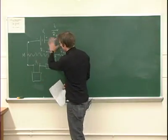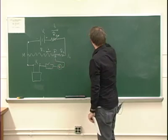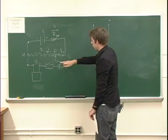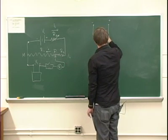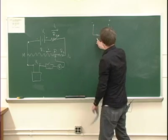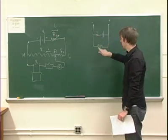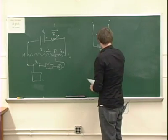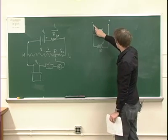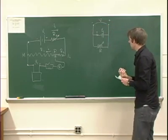However, we're going to do it in a slightly different way. We're going to keep everything the same up here in the upper circuit, except for the lower part we'll modify slightly. Instead of having it just look like before, we're going to put the battery as before, but now with a secondary resistor in parallel. This internal resistance is little r, and this external variable resistor is capital R. By changing R, we change the potential applied across the two nodes. So let's say there's a potential V up here.